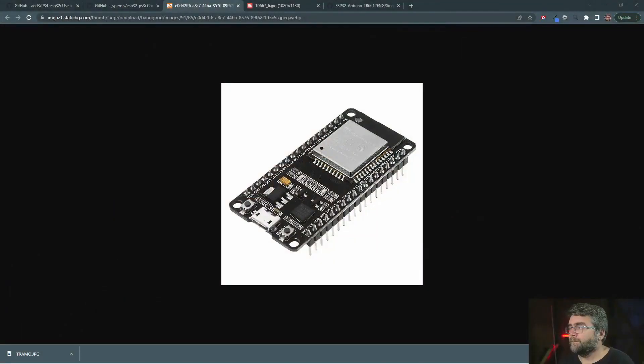Fast forward half a day and I've decided to use an ESP32 controller. It's got Bluetooth built in, so if I used another controller I'd have to get a separate Bluetooth module and get them talking together. With the ESP32 everything is built in, plus Wi-Fi as well. We want Bluetooth because all the PlayStation controllers are Bluetooth - you can pair your PlayStation controller to a computer or phone just through Bluetooth.